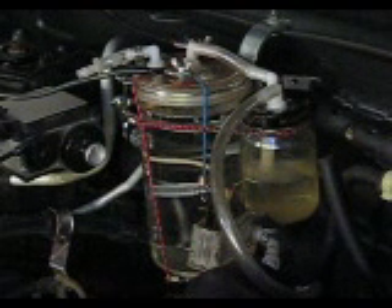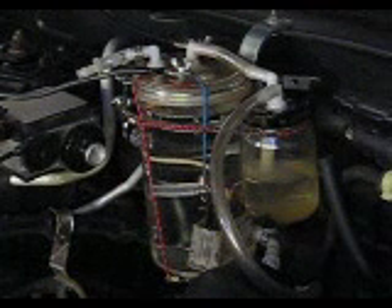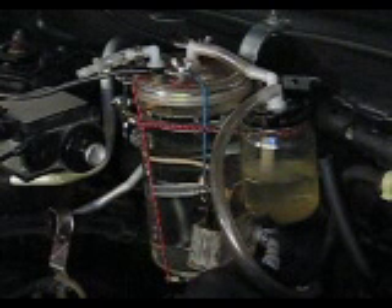Hello again. I just replaced the water in the unit and topped off the gas tank. I put enough distilled water and KOH in the unit to bring it up to 20 amps. I'm going to give it a shot right now and see how much bubbles come out of that bubbler.